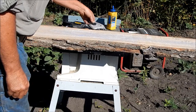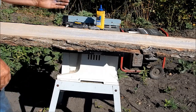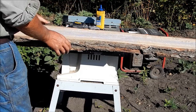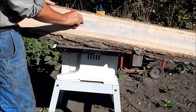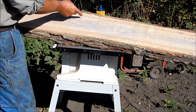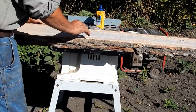I'm going to take the table saw and run it down that line to get two pieces which will be used for the handle. I'll cut here, get this piece out, then flip it over and cut here. Like I said, I'm cutting a lot bigger than I need to, then I'll edge it down with the planer. That way I can keep an eye on it and make sure I get it right with the grain.